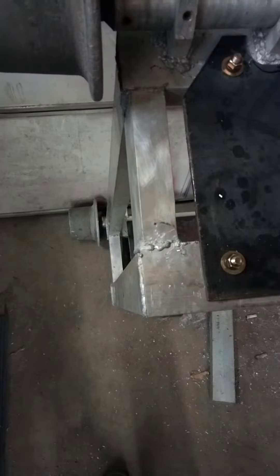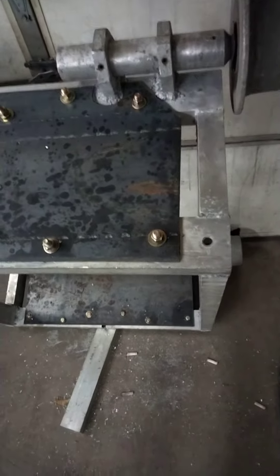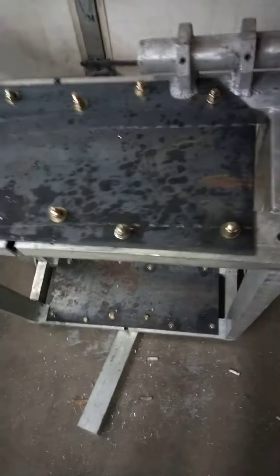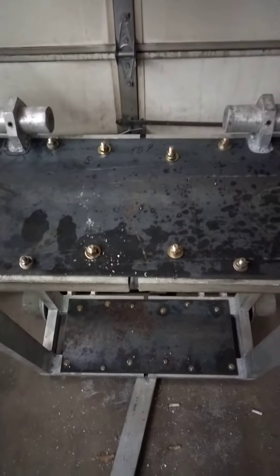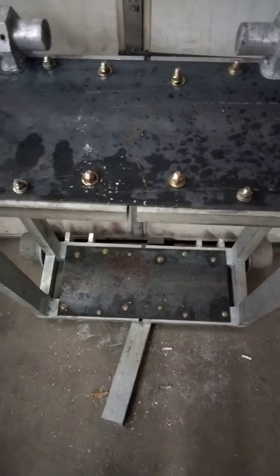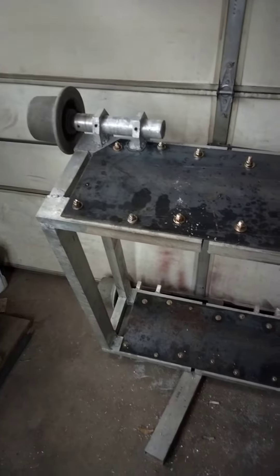Ended up with a little train cart to modify. They got the Georgetown train loop shut down. This is a little aluminum cart that somebody made in Denver. They put about a thousand pounds on them and pushed down the tracks. But it was set at 54 inches wide for this Georgetown track, so it needed to fit the next narrower gauge of track.